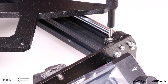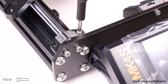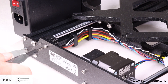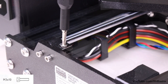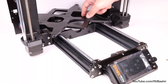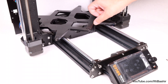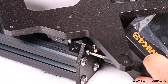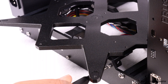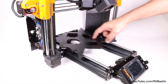With these in place, insert another M3 by 10 screw into the holes we left facing upwards, in order to tighten and grip onto the rod. Repeat on the opposite rod end. Repeat the same process at the back end of the carriage too, so secure the rod holders to the frame with M3 by 10 screws without fully tightening, and then insert the M3 by 10 screws into the holes in the top and tighten. With those in place, move the carriage back and forth — it should move freely and smoothly in either direction with very little friction. Once confirmed, move the carriage fully to the front plate before tightening all screws in the front rod holders. After which, proceed to move the carriage all the way to the back and tighten the rod end screws here too.